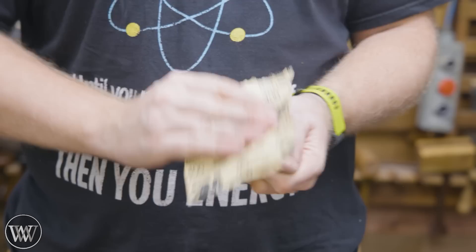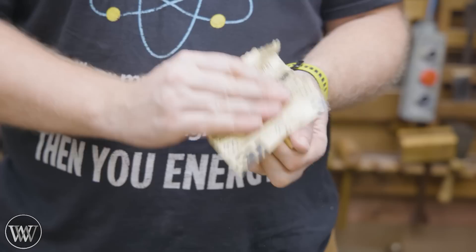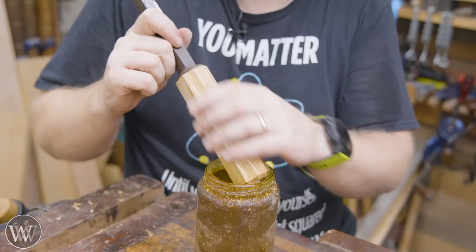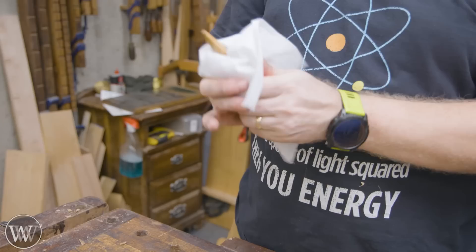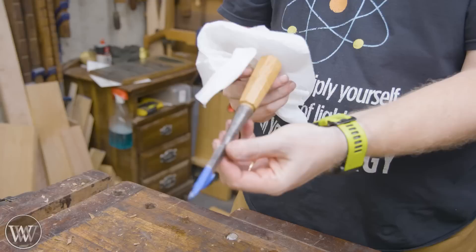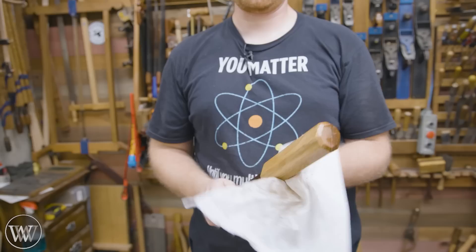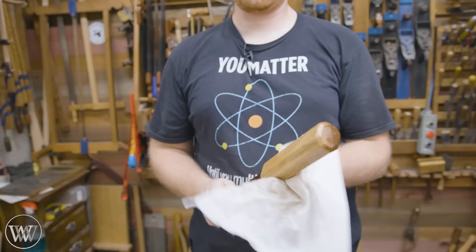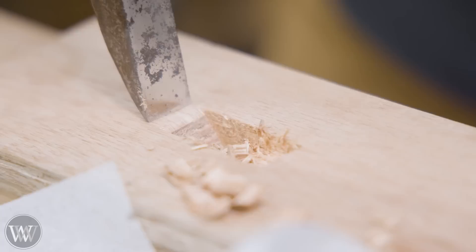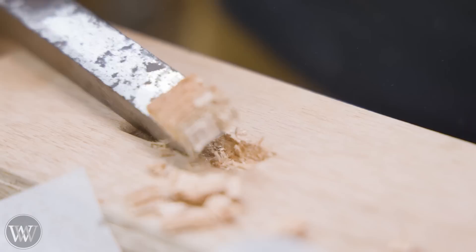To get ready for finish, I use 400-grit sandpaper to clog the pores with dust — this lets the boiled linseed oil soak in a little farther, as the dust wicks it deeper. On the socket handle I don't put finish on the socket itself, keeping that area clean. Then I wipe it all off, install the handle, and just like that we have a finished chisel. I take the big three-quarter inch mortising chisel for a test drive — you can really wail on it and it drives down, cleaning out heavy chips very quickly.